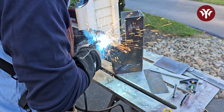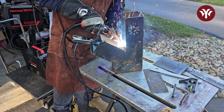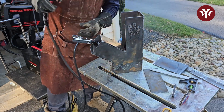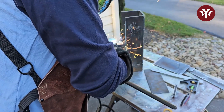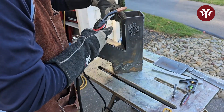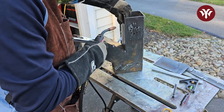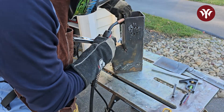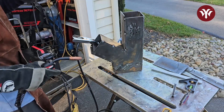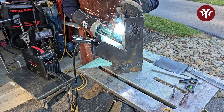This next piece is the one where I cut the bend lines. The angle was so severe that it made the joint weak, so I decided to put it in as two separate pieces. I'm lining it up and tacking it in place, then I'll take the upper piece, line it up, and also tack it in place. If you notice, this piece is taller than the rest of the unit, so I'm going to use the Cut 65DS to cut it flush so it matches up perfectly.